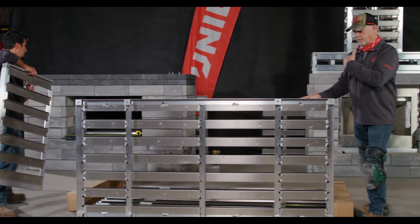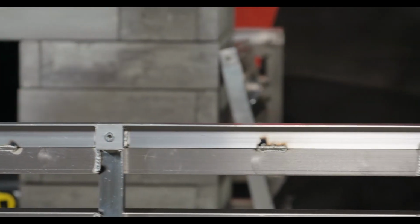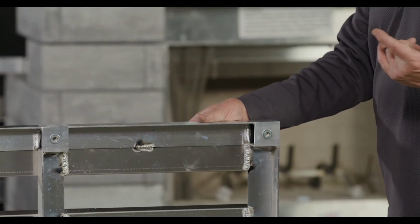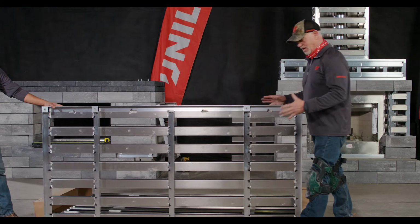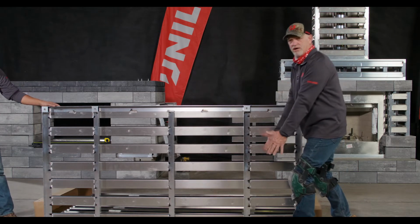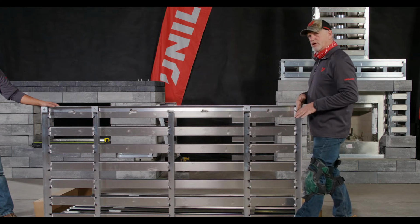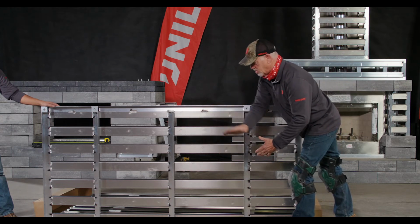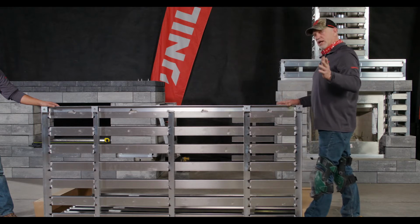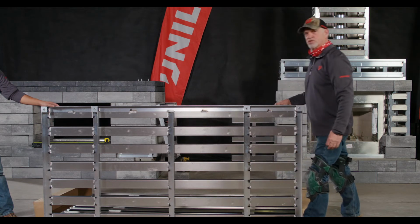What I like to do during construction is attach those end clads here on the end and here in the middle, in this interior cavity, but keep this end clad off for a temporary position. The reason is that if you look at a fireplace, if it was going to be true wall material or a wider material, I'd have limited workability to connect the attachment for that fire pan. So you can keep that end clad off a little bit and run that material around. It's going to be structurally sound, being held together front and back with these 3 end clads. It also gives you the opportunity to get your valve installed as well as plumbed into that fixture.